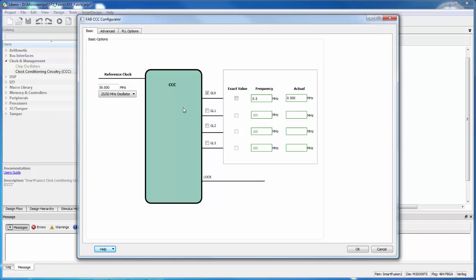We're going to use the PLL, which gives us the opportunity to use the internal RC oscillator without needing another clock source on the board. We could have put an even bigger counter in the fabric, but that would use more fabric resources. So we might as well use the PLL to generate the slowest clock we can. We're still going to have to divide it down further or else we'll never really see the LEDs blink.